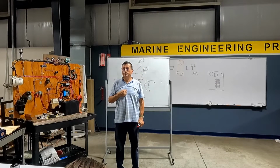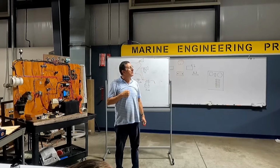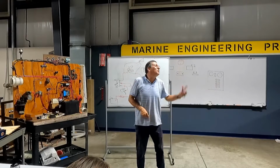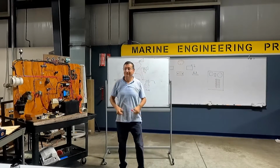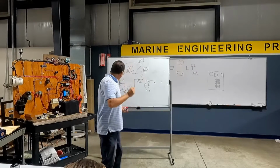Okay? Good? You really never want to do it in parallel, especially with 3 bilge pumps. Just like you said, one pump goes out, it might take the other 2 out. In series, no. Series, in parallel, I'm saying we don't want to. You'd rather do it in series. No. In parallel, if one is broken, you have two. Oh, sorry, you're right. In series, if one of those is broken, you don't have any. Hold on. It's too early, man. I'm still waking up. Yeah, you're right.